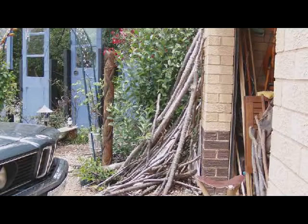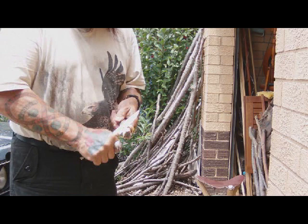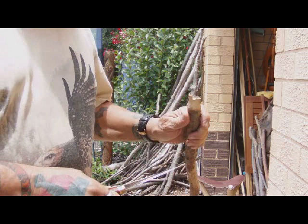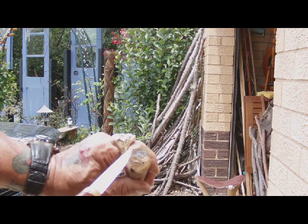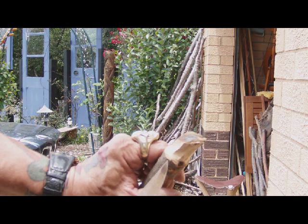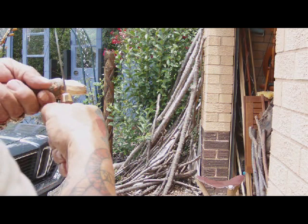Okay, so here we go again. Slicing away, and making sure that you have in fact made an appropriate diameter circle, center of the stick, so that when you slice, you stop before that, and then you can do a fine controlled paring of the wood down to the shoulder, so it's an even diameter down this section. So, you know, it's really about cutting and turning the knife